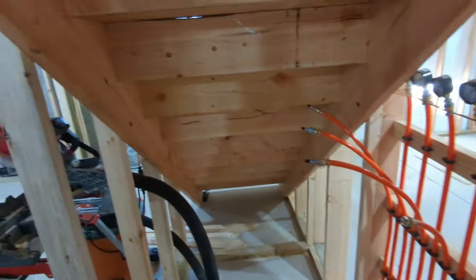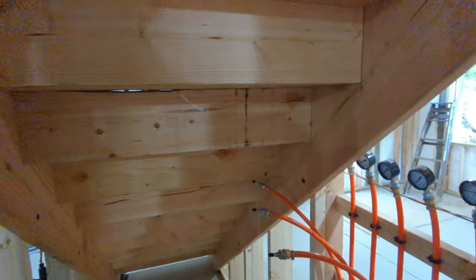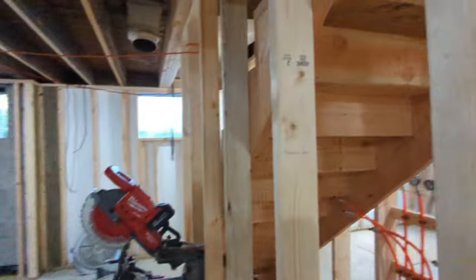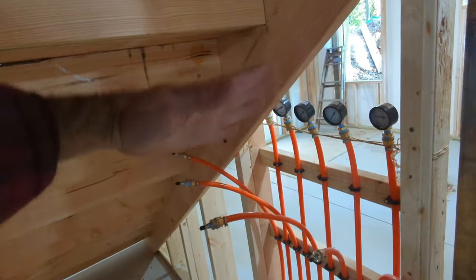We are going to have to drywall this entire cavity, because stairwells are a big opening, and if the stairs, being solid wood, become a raging inferno, then it can go upstairs and keep going. That's why it had to be drywall up in there, and we'll have to have the same thing here. So this will actually feel a lot more oppressively small.